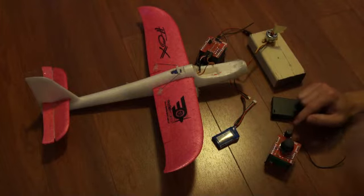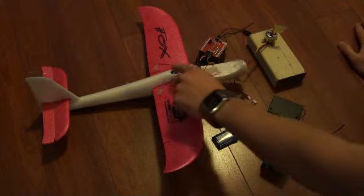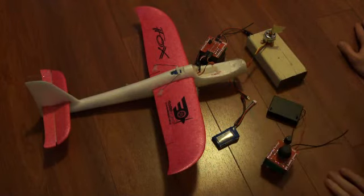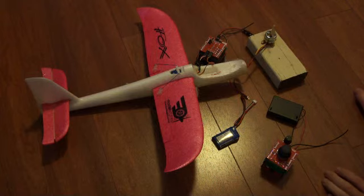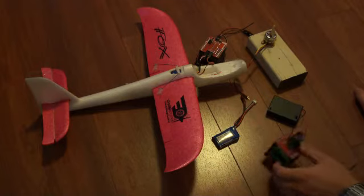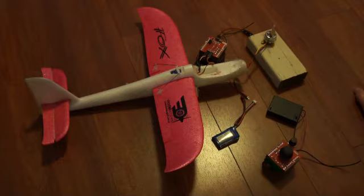Now, what's happening is, because of the serial in from the wireless transmitter and receiver, there's a bit of a jitter with the servos. The motor's not too bad, and there's a bit of latency or a bit of delay, I guess, to speed it up and slow it down, but that's sort of acceptable. The problem is with the servos, they're a bit too jittery. Now I've got 14M2 microcontrollers, PICAXE 14M2 microcontrollers on both the transmitter and receiver, but if need be, I'm happy to go to a 20X or something else to be able to do a HSerIn or something like that. So I'll show you what it does.